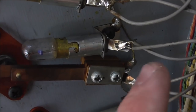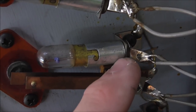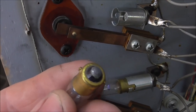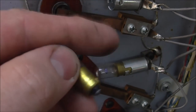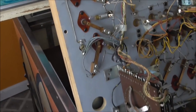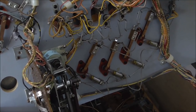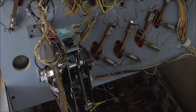That's how it gets its power - one of the wires is soldered to the bracket and this is just press-fitted on, so over time they get a little loose. Spinning it gets it to a place where it makes a better connection. You also need to make sure the wire isn't shorted out where it's touching the bracket, because then you're shorting both lines together and it'll blow the fuse. You can also see how it oxidizes the surface of the bulb - you can take a small brush and clean the pin in there. If you get one that's all loose and wobbling, you need to replace the socket, but usually you don't have to do too many of those.